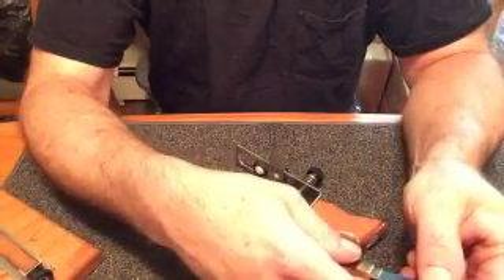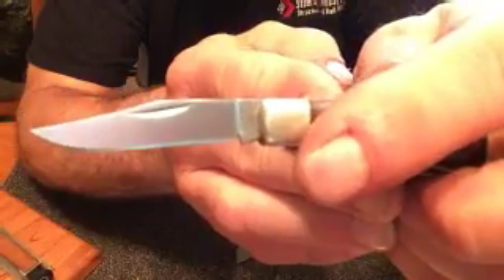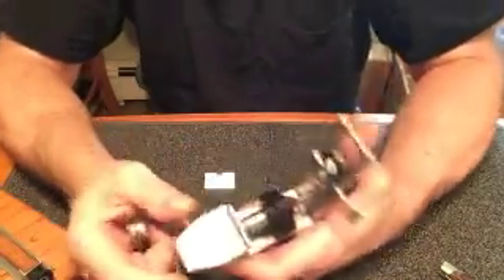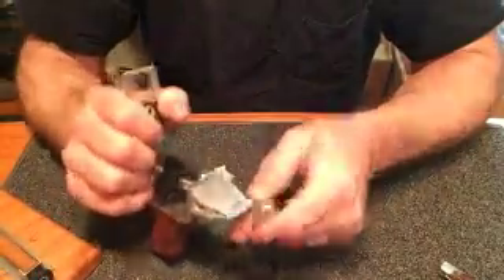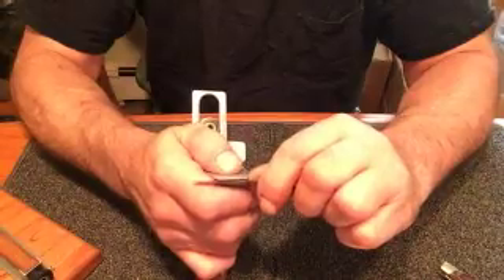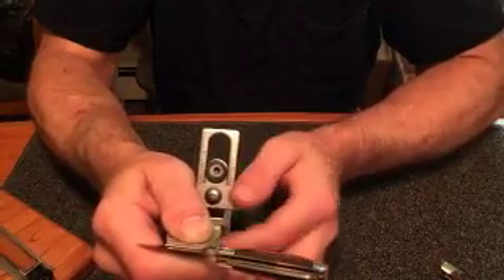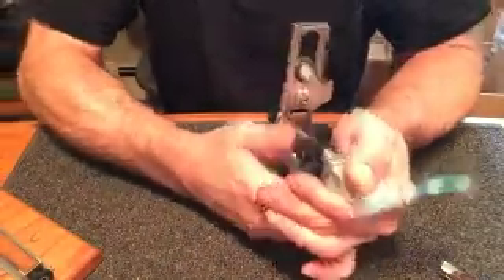Here's a Buck — I believe this is the 308. This knife is a full hollow grind from top to bottom. When you're into slip joints, a full flat or full hollow needs to go into the clamp just a little bit deeper than a saber, but it's still the same thing. I like to do it with the nail notch up so I can see what I'm doing — gives me a better sense of how much I have in there. I have it positioned, I'm pinching, then snugging, then hold the clamp and tighten. And there you go.